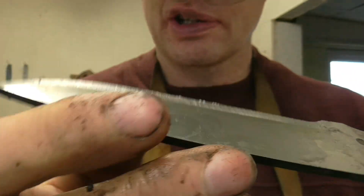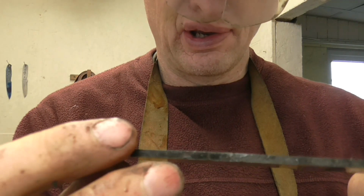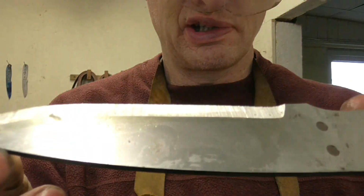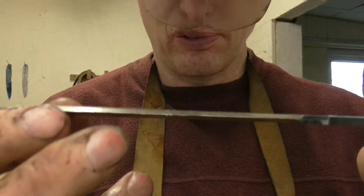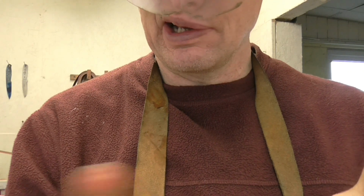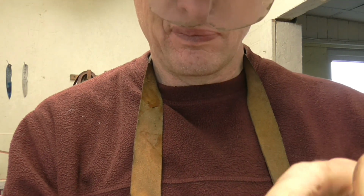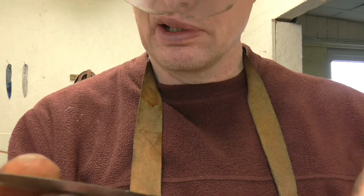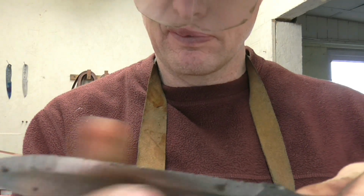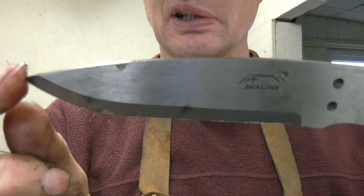So that's the first grit out of the way. And at this stage, I just visually check by eye to make sure that both the grinds are reasonably even, the plunges look reasonably even, and the tip looks reasonably equal. And then as I refine that, I go through finer grits. Obviously when you go to the much finer grits, the polishing belts, you can't change much then, you just polish. But I will actually go to a finer grit now, and then I'll put calipers and verniers on this bevel to check that both sides are equal. So that's what I'm going to do now.